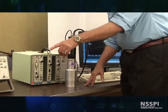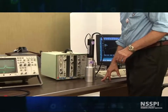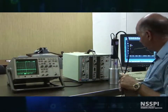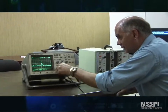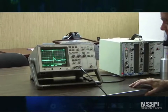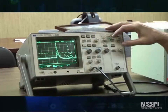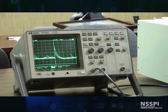Let's move over here and look at what the pulses look like coming out of the detector. So we can take the signal from the sodium iodide and go into our friend, the O-scope. And there they are — we can see the gammas. They're relatively slow pulses. This is set on 200 microseconds, so you can see it takes quite a while for them to come down.